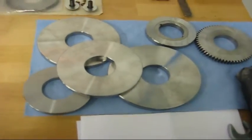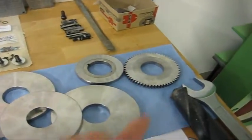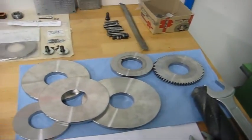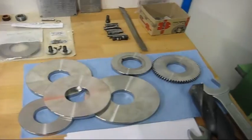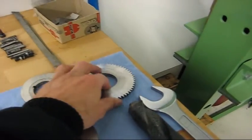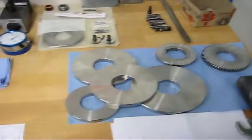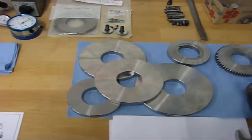This last weekend I managed to finish the gear blanks for the metric threading. Two of those were already finished. That gear is only missing the keys. Originally I had planned to make the gears twice as thick, but that was before I realized you need to put two gears beside each other on the banjo and there's only room for this thickness. So that gear was cut down — before, it was almost twice as thick. This weekend I removed half the width on that blank too. Those four blanks are brand new, all made from 4140 heat treated, so they're about 30 Rockwell C.